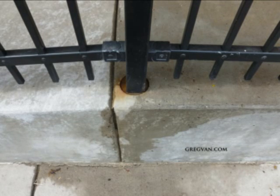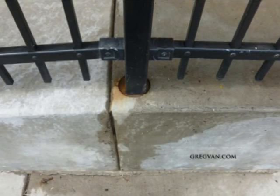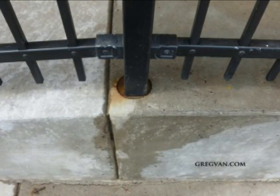If you have a post that's not flush with the top of the walkway, you could just add a little filler, fill it up a little higher, and you could always slope it away — a little higher near the post and a little lower toward the walkway. Anything to divert the water and keep it away from these posts is going to be beneficial. The last thing you want is a little hole where water can accumulate and eventually rust out or corrode the bottom of the metal post, leading to another repair bill that shouldn't have been required by the property owner in the first place.